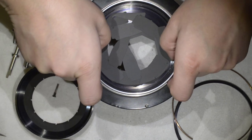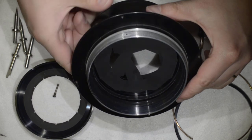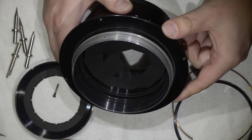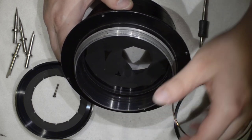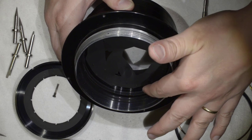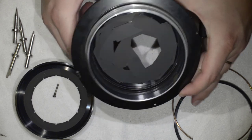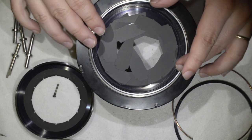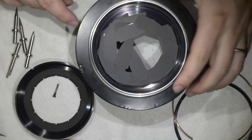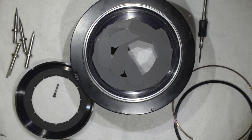but I am not able to remove it yet. I don't know why. I tried yesterday. But what I see here is that this ring outside here seems to be screwed. So what I can do after cleaning the optical elements is try to put some lighter fluid to see if it gets a bit loose, and probably the grease which is behind is going to dissolve. So I'm going to get the cleaning stuff to clean the lenses first, which is for me the most important thing, and then we'll take a look at this ring, which is blocked too. So I will come back in a few seconds.